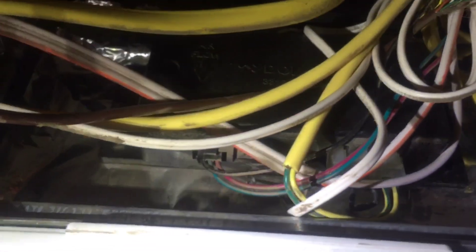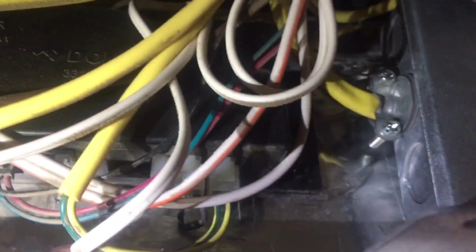- that second plug on the right is what they call an end-of-line resistor. It looks like it might be broken, maybe not - I'll have to pull it and feel it to see, but that's what talks to the air conditioner and makes it turn on. It may also control your fantastic fans, because there's a hole right there that looks like a telephone plug that would connect to your fantastic fans. Some Dometics have a plug set up on the outside, but this one doesn't, so all my stuff is in here. I did notice the airflow direction indicator is pointing the wrong way inside here, but I don't think that makes a big difference. I'm going to pull this out and see what's up.